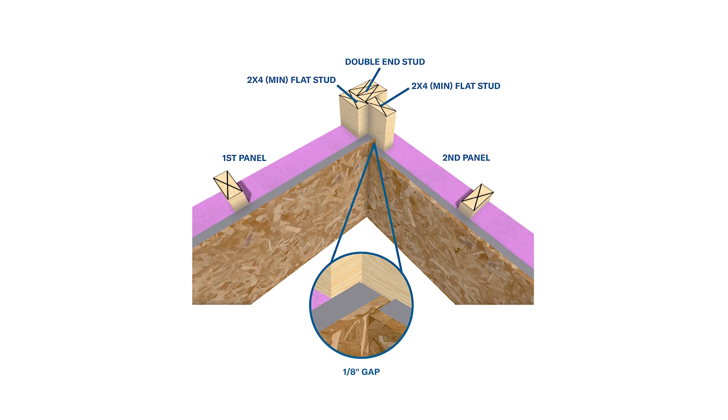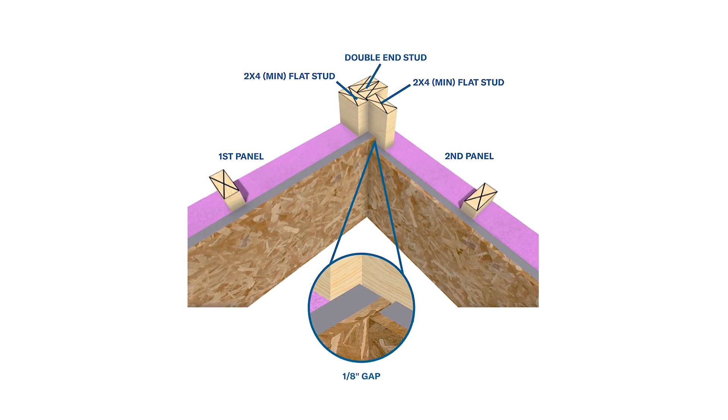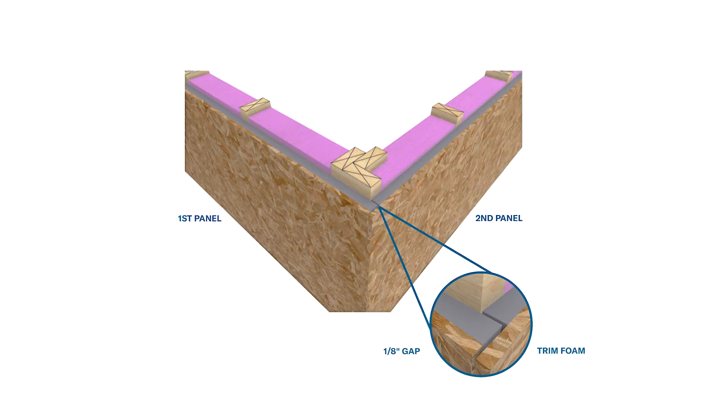One of the things about corners: if you're doing an inside corner with a member that doesn't meet that corner enough for support, you are required to install a sleeper on the other side of it. On an exterior corner there are two approaches. One, you can overlap the foam to the external sheathing material, or you can cut out the thickness of foam and overlap with OSB. This allows you to determine what is best for the builder and how to best attach the facade on the building.